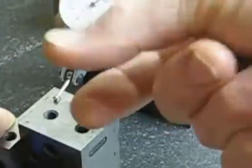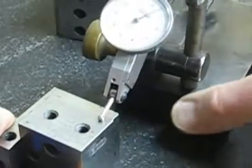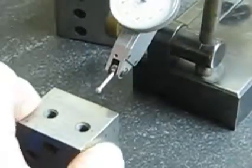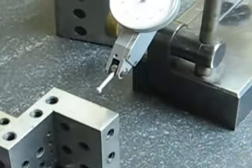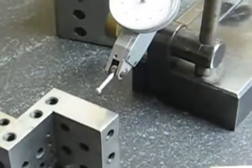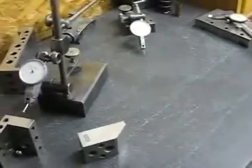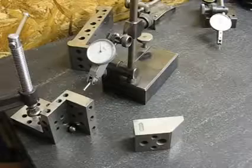So the total — that surface lies within a tolerance zone, a total variation from perfect perpendicularity of seven ten-thousandths of an inch, or seven tenths of a thousandth, as the machinist or toolmaker would say. So again, this is a compound angle plate resting on a granite surface plate which is flat basically within forty millionths of an inch over its entire surface — I believe it's eighteen by twenty-four inches — so you can use a lot of area for checking. There you have it, that's a setup for checking perpendicularity.